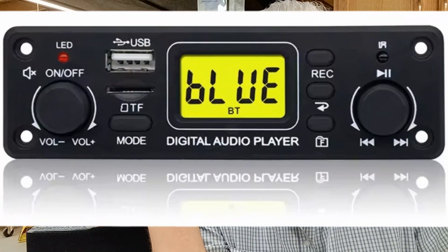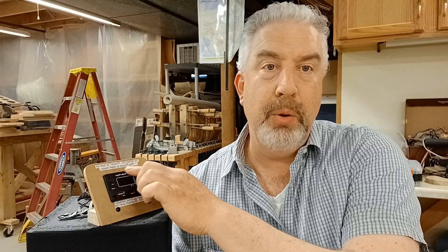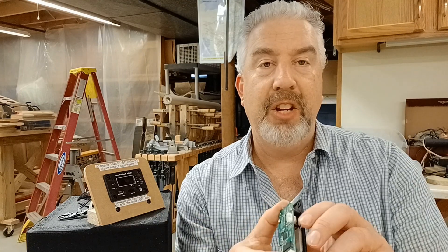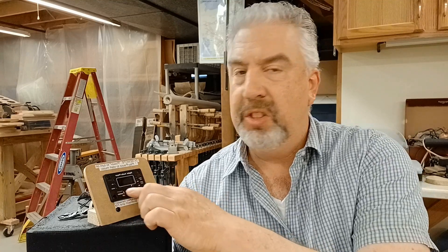Don't buy it — I'm taking this thing out. What I'm going to put in its place is a half-decent preamp unit with MP3 player and Bluetooth all-in-one, which I reviewed as a bigger brother unit a year or two ago. This one was like $12 or $14, is just a preamp, and the connections they give you in the back are decent size — I won't even have to trim or splice into them. I can connect it directly into this amp from the jungle site — advertises 50 watts per channel. Probably at 4 ohms with the 20 volts from this battery, you'd get maybe 20-23 watts per channel, but that's plenty for these speakers.